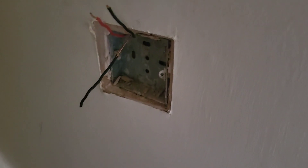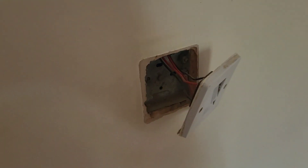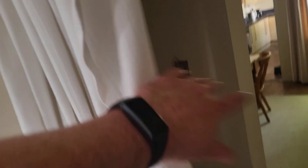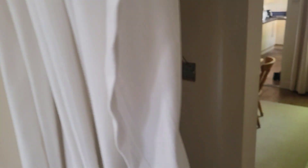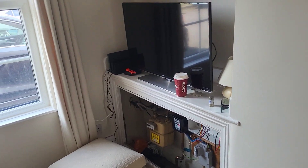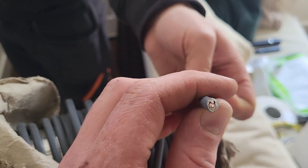We can run twin through into the common, use the twin, get rid of what they've done there — twin out of L1 and L2 up to L1 and L2 at the top of the stairs, and then we've got the switch wire up. Whoever's done that is just obviously not thinking. We'll put a 20mm hole in the back because they line up pretty much, and use the single brown and earth.